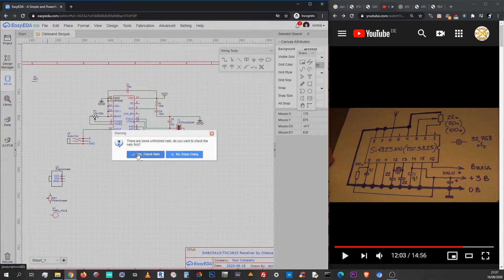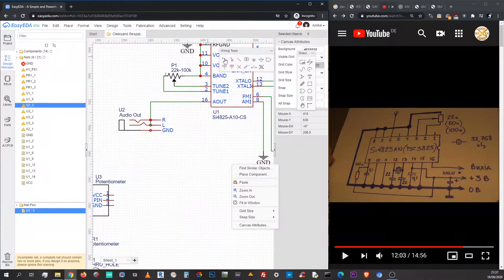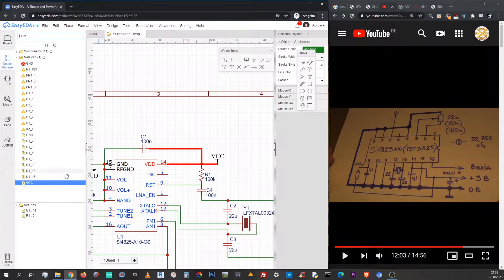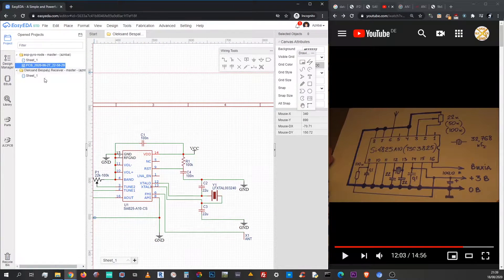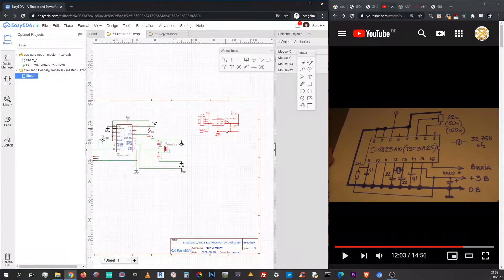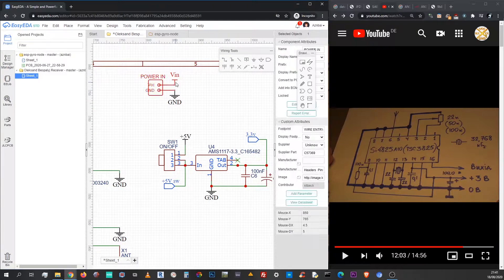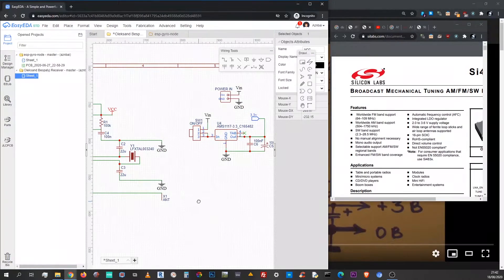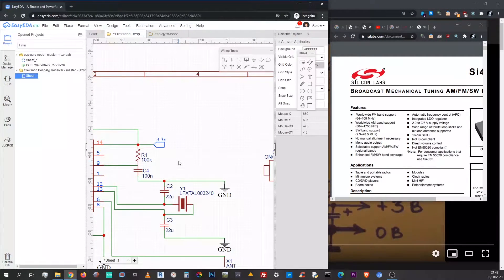Now we are ready to save the project and convert it to an actual PCB, but before we do that it's good to check all the connections — the program does it for us. It throws a few false positives on pins that are not in use and on unused components, but it's a nice tool for a first debugging check. I then remembered that I wanted to add a voltage regulator, which I copied from another project — a motion capture node. The voltage regulator add-on lets us power this circuit from a source of up to 12 volts. Those connections are called net ports — basically like a teleport, so you don't have to draw a wire across all the schematics. It helps you split your circuit into modules.